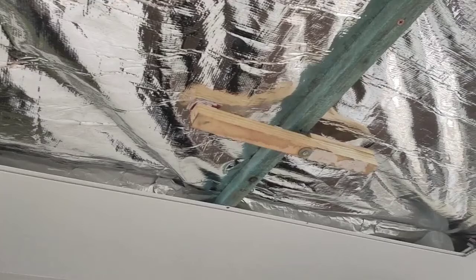For the next and remaining panels, I used the 3 swinging mounts that I mentioned earlier. They were positioned as shown in this clip, well away from the previous panel, and mounted in, if you like, the passive position. In other words, the body of the swing mount is parallel with the edge of the previous panel. This leaves clearance for the next panel to be lifted up into approximate position, and then for the swing mounts to be swung at 90 degrees in to support that panel.